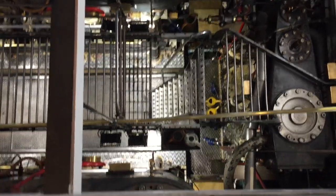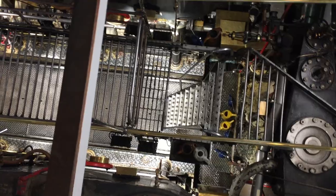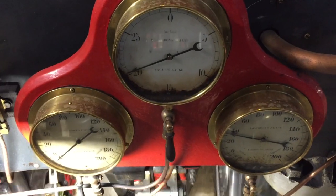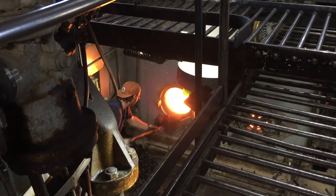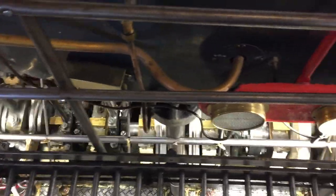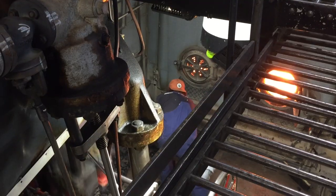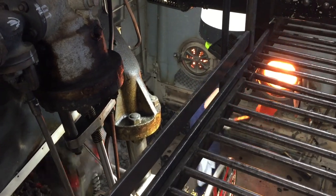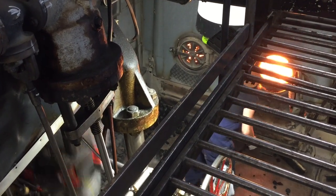Quite naturally, we took a steam-powered trip across the lake because, for me, the Earnslaw offers a rare opportunity to witness a triple expansion steam engine in full flight, which, apart from anything else, reminded me how quiet the power of steam can be. For the Earnslaw, her triple expansion engine allows her to take full advantage of the cold lake water, extracting more power from the steam by expanding it down to very low pressures. For future sustainable locomotives, the opposite is almost true.